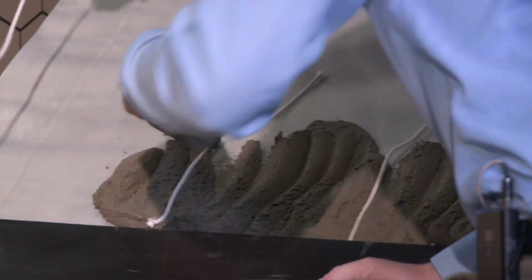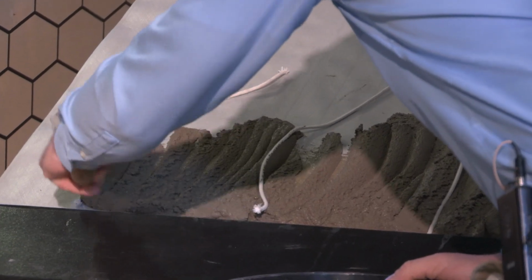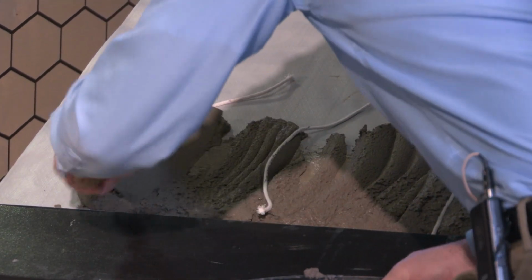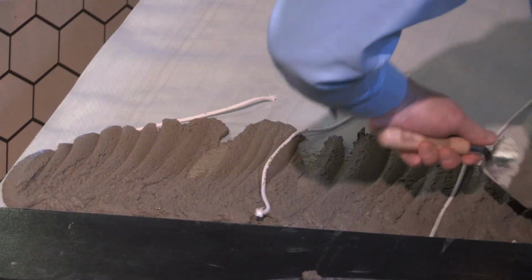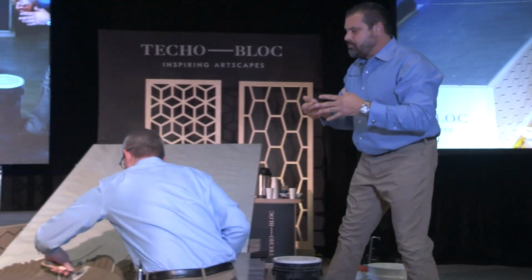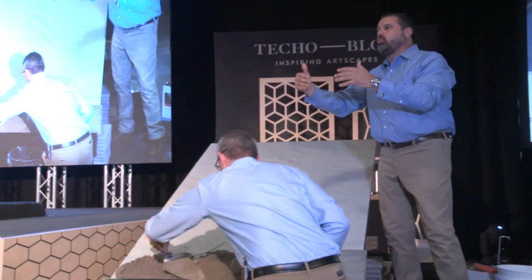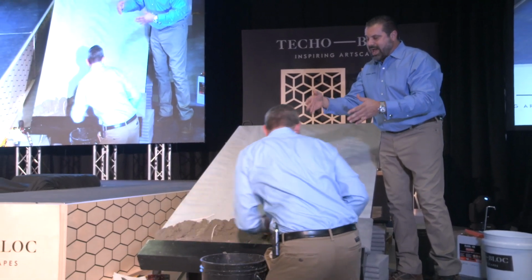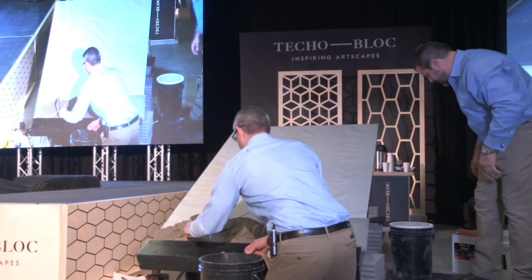Okay. Now, when we put that coping in, let's put one in here, too, Rick. We're going to put it with a slight pitch back. I mean, a 16th, a 32nd of a bubble, just a slight pitch back. So that mason cord will help wick out some of the moisture from that mortar bed and allow it to escape so it won't expand and contract.